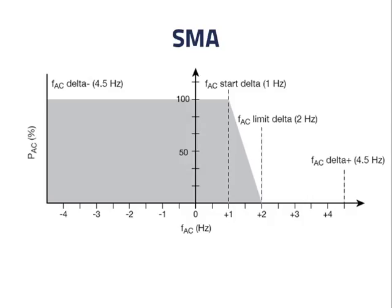The other issue with this approach is that it only sets the PV inverter's output as a percent of what it can put out, but what the inverter can put out may vary rapidly with cloud cover. We would like to be able to set the inverter's maximum output based on the loads, and the inverter should try to hold this even in varying light conditions.